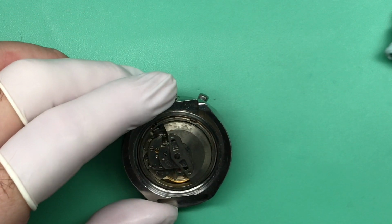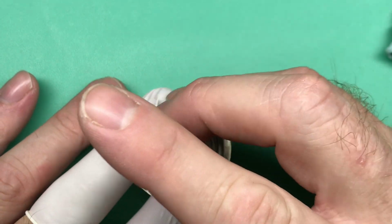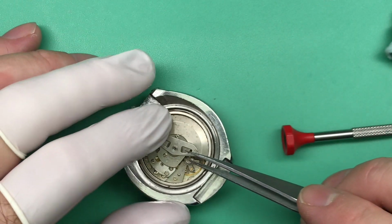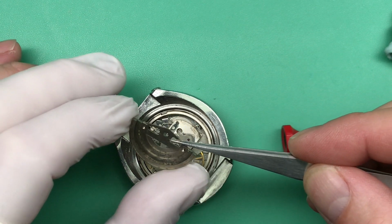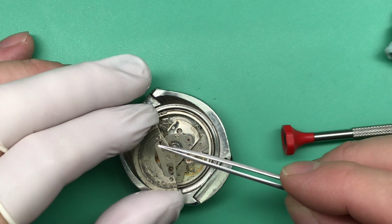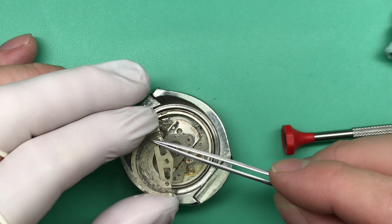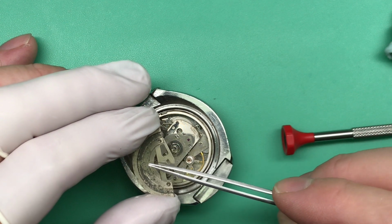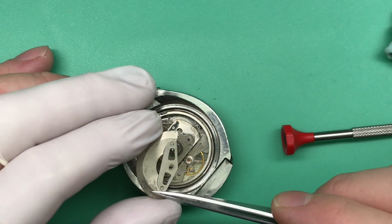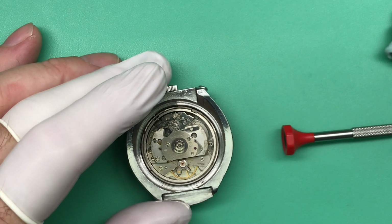All right. Well, we're still running. That's a good sign. I'm going to go ahead and remove your winding weight. I like to take some components off, and you can see here, you see this pitted surface? This is from moisture. This is where the moisture has been on the surface for a prolonged amount of time and extracted some alloys, some material from the winding weight. And you can see that it was here as well. So definitely has been quite wet in the past.